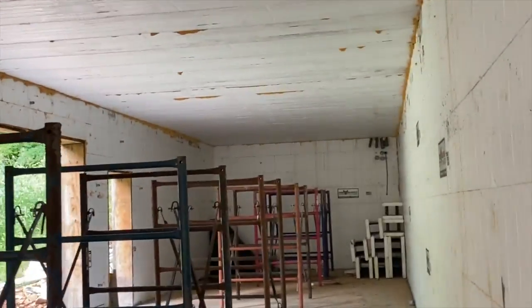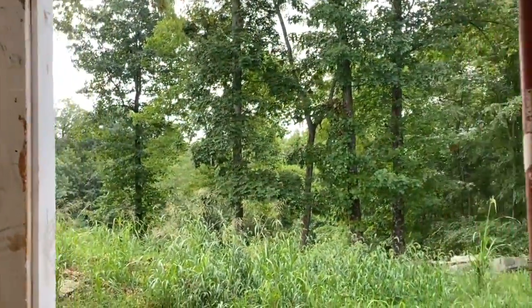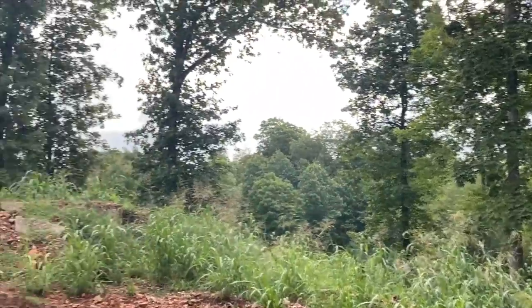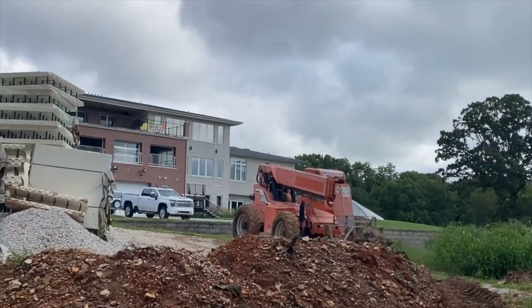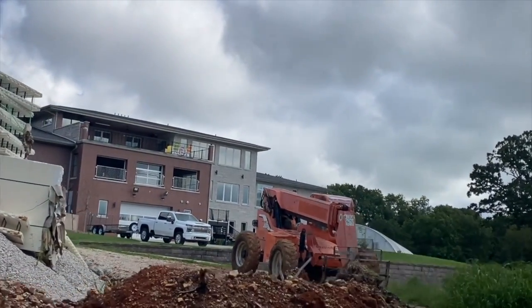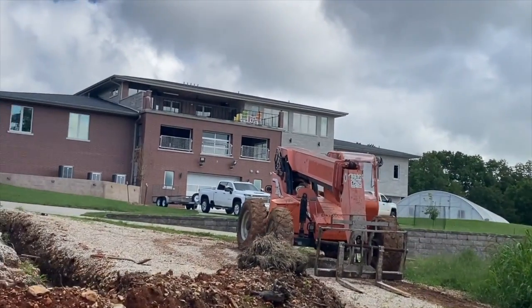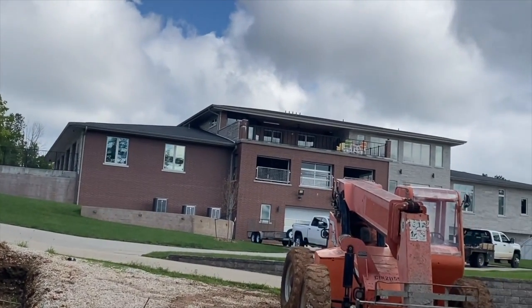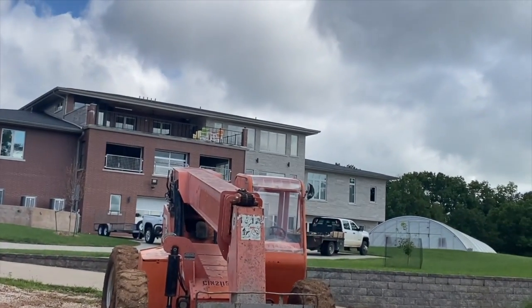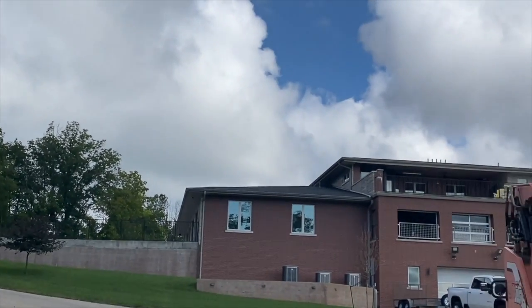This little project is going to take this amazing project, the entire house and everything that was started in, I believe, 2014, 2015. It's a 12,000-ish square foot all ICF build. I'll link the video to the tour of it that I shot a few months back. But this house uses less electricity than the average 1,500 square foot house. They had 1,100 amps of electrical roughed in to this house, and it uses less than 60 amps on a regular basis. So it's not going to be that hard to take it to the point it's off grid with solar.